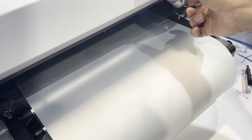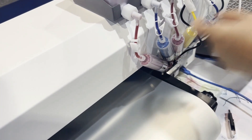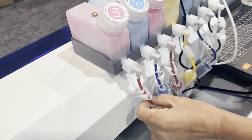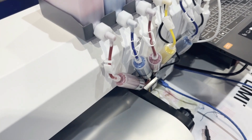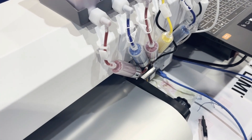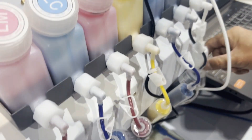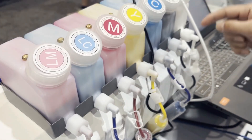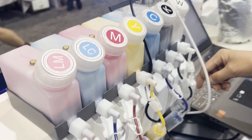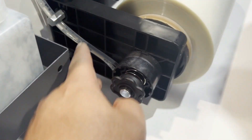Starting back at the printer — for the film, you can use both A3 and A3 Plus films. On top of the film, you have ink filters. Sky, the CTO of the company, explained to me they are using column filters right now, and also considering changing to a disc filter to save space. I explained to Sky that many companies cut corners and only have a filter for the white, but Sky thinks every color must have its own filter.